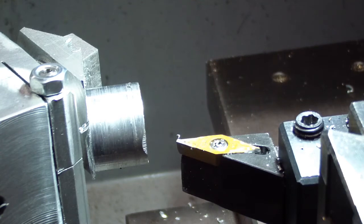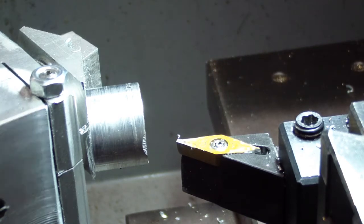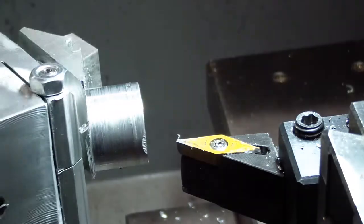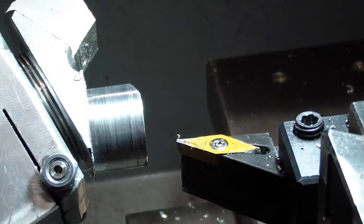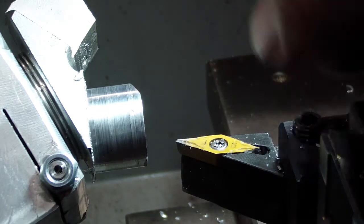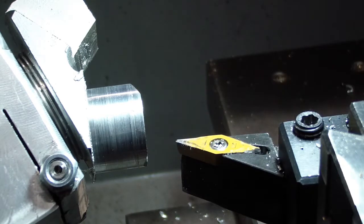Okay, I narrowed down the problems that I was having with the machining of this part. As you can see, I've done some passes now on the cylinder head, and I have a more robust V-shaped insert, in the V-class, I think it's a VBMT. It's carbide that's been coated. I've had it for quite a while. The holder that I've got right here was a 3/4 inch holder, and I've only got a 5/8 inch space for that to occupy, so I had to machine it down, and believe me, machining hardened steel on one of these tool holders is no fun. But I got it done.